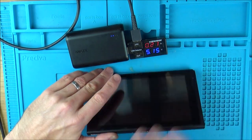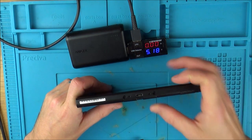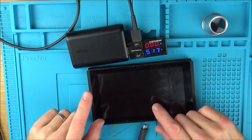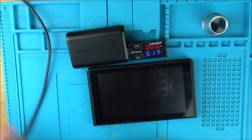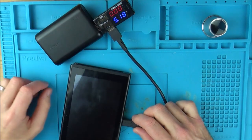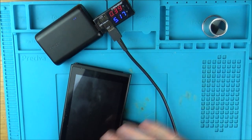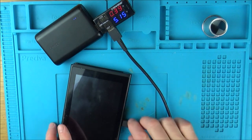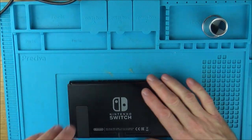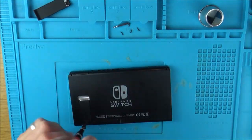I'm going to have a quick look in the USB-C port with my eye loupe. To my eye it doesn't look too bad — I can't see any bent pins or anything like that. I'm going to plug it into my computer just to see if it recognizes it as a USB device. It's definitely not being recognized. I tried the lead both ways — nothing. When I plugged it into the PC I did see the backlight light up, confirming it's definitely not working. Let's take this thing apart and do some testing on the capacitors.